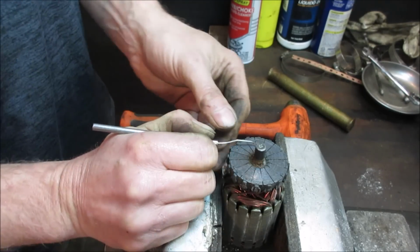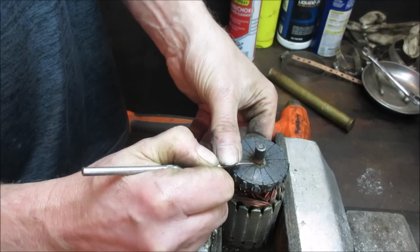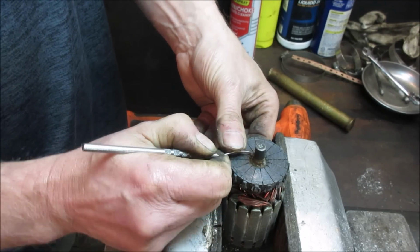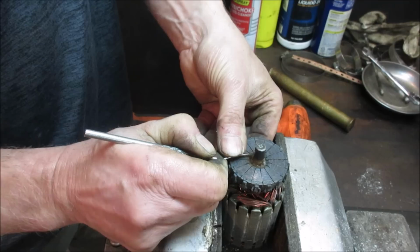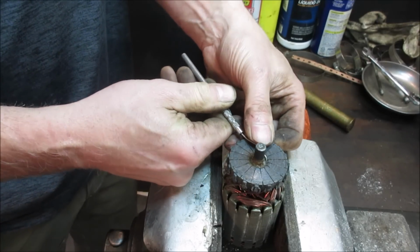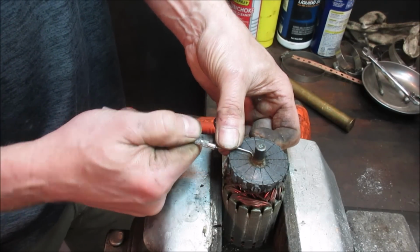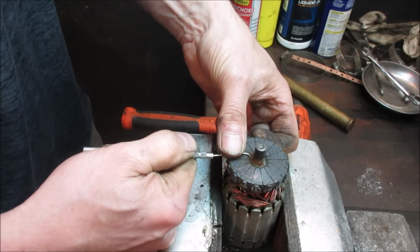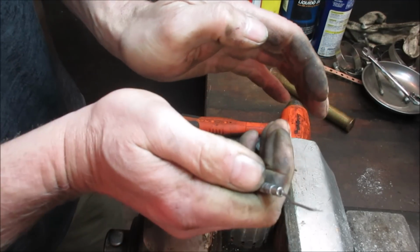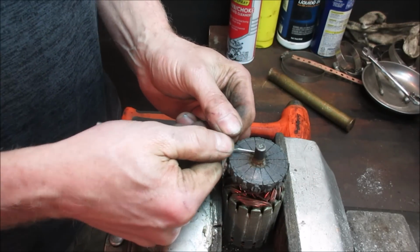I think I took one of the Harbor Freight ones apart a long time ago. And that actually had O-rings on the body, like a big O-ring going around. And I think the O-ring had failed, just the quality of the rubber was real crappy. And when I took it apart, I think the magnets on that one were what the damage was. The magnets, like I talked about, the rust got behind them, that white corrosion on the aluminum housing caused the magnets to kind of crush inward and bind up on it. Doesn't seem to be the case on this one.